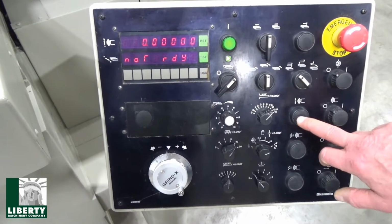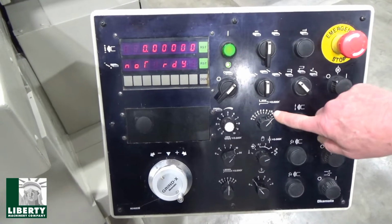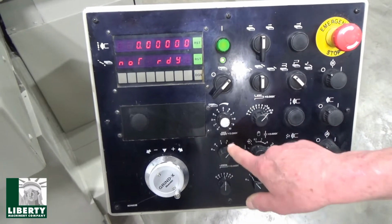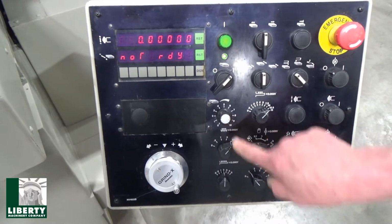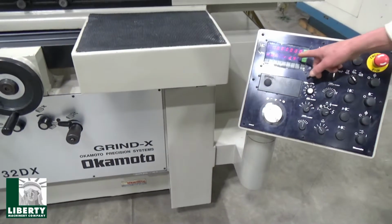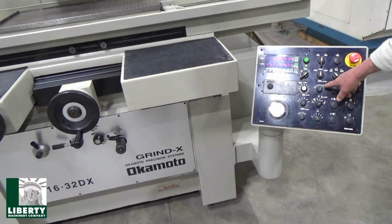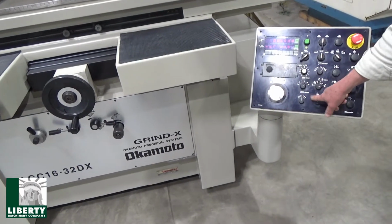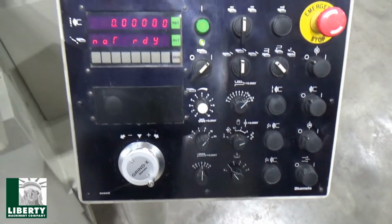And this is incremental down on the spindle for whatever you've got it set at. In this case, we leave everything at 10. This is at 10 tenths on coarse. At 10 tenths or 1,000th, we transition over to fine feed down here, which I've got set at 2 tenths. So I'm just gonna set it up at 10 thousandths. We'll take off 10 thousandths off our imaginary part, go down to 9, transition at 9 to 2 tenths with 1 spark out I've got on here, and maybe we'll play with the pulse generator a little bit.